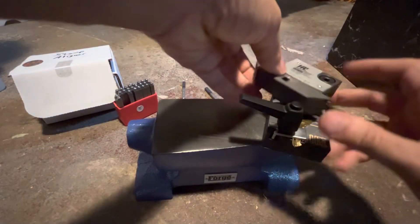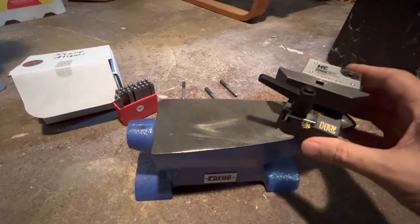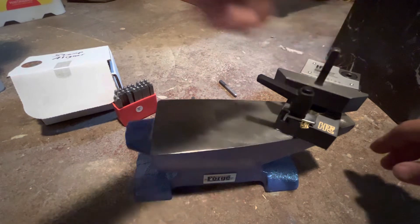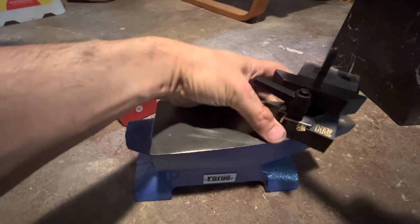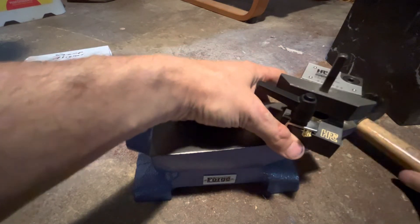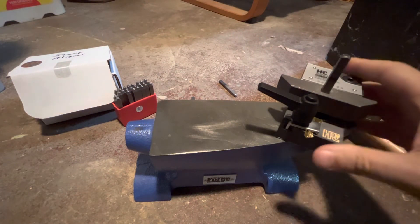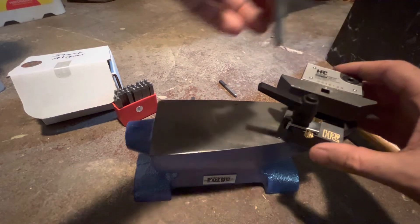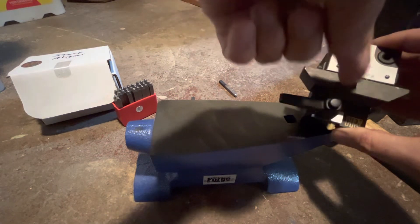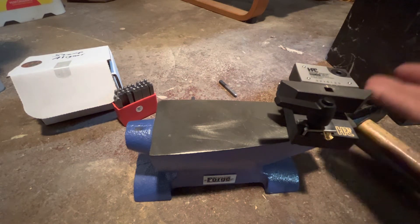The other thing I've learned is that when I first started doing this, I was trying to do it quickly. I would say I need to do B, B, A, C, C — so I'd grab B from my stamp thing and whack it, and then just move on. What I learned, especially when the key occasionally moved around, is that even if you have two things in a row, I'm going to check it each time. I'm going to open it and put some overhead light and look down the little hole. You can see whether you've actually stamped it. I'm going to check it after each letter because it's slightly slower, but you actually make sure that it stamped where you thought it did and that it didn't move around.